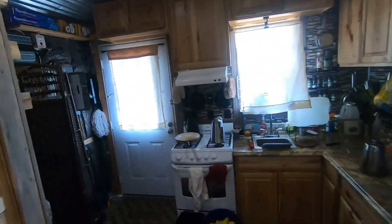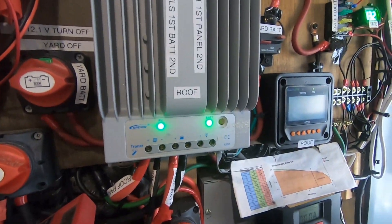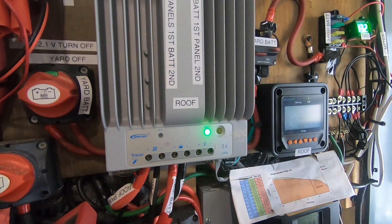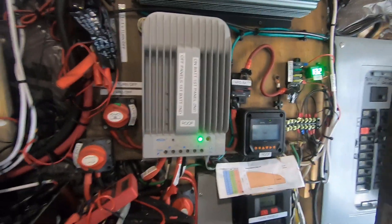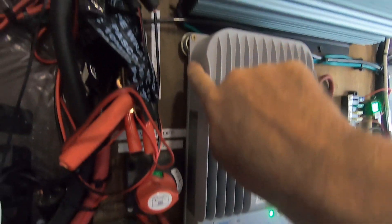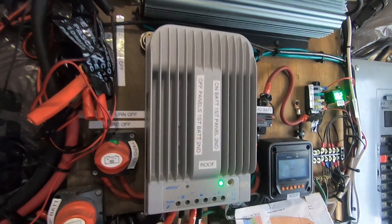I really like these things. Being a little anal retentive, I like looking over here and seeing that green light flash — if it's flashing, it's charging. With this controller you can see the icon showing the voltage coming in, the amperage, everything at a glance. This is for my refrigerator and I'm at 31 amps. It's a pretty solid charge controller; I haven't had any trouble with these. Something I do — you'll see this washer — I like an air gap on these things. They don't get hot, but if you've got air flowing around a component it just makes them last longer.